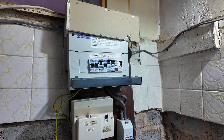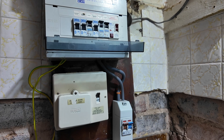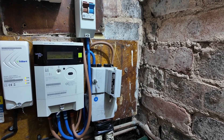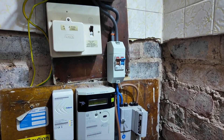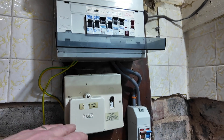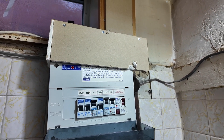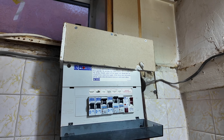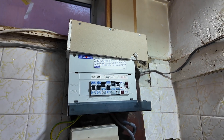We need to install an EV charger. We can see what we've got here — probably an old consumer unit for a shower or outbuilding. It is a loop supply but we're told it's been unlooped, so we believe that's already been done. Either way, we'll fill in our ENA paperwork and they'll advise the customer on next steps. We've got the meter tails going into the isolator. We're going to strip this out because we don't need it anymore. For the EV charger, we don't want to share that RCD because it won't be a Type A. We could have put a Type A RCD in and swapped the EV charger into this fuse board, but then we've got no surge protection, and of course we've got a plastic consumer unit.